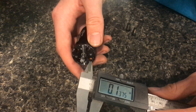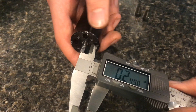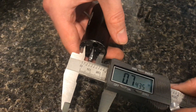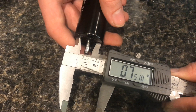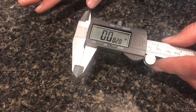All you've got to do is put the calipers and expand them out in one of your holes, then hit the zero button. Then just expand the calipers into both holes and the number displayed on the calipers is now the center-to-center distance.